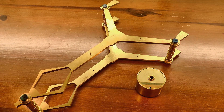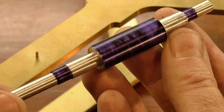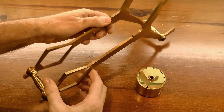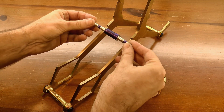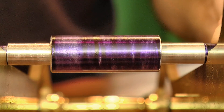I've turned a quick demo from a piece of aluminium to show you what I mean. The arbor has a series of stepped shoulder features that have to be dead on for it to work, and some of the key dimensions for those features must be taken directly from the clock, like for example the pivot shoulder distance. For the clock to run freely, there must be a small amount of clearance between the arbor shoulders and the plates, to give a little bit of end shake.